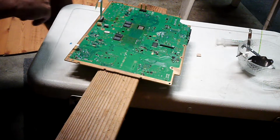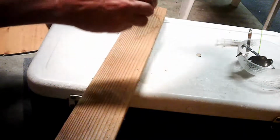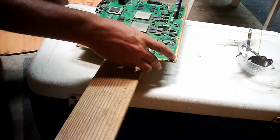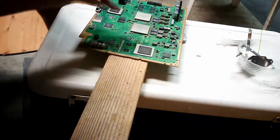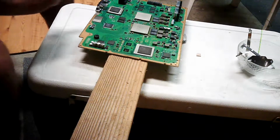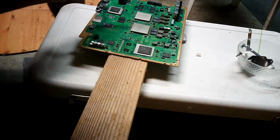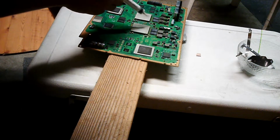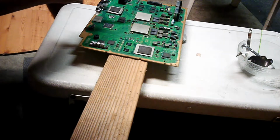Alright, this is cooled down. Go ahead and flip this thing gently back over and put it in the same position that it was when you started this side, so that the prongs are hanging off the end there and this is flat. Okay, a note here. There are so many different ways of putting on heatsink compound. It's ridiculous. One of them, which started way back in the day, is to put a line on here and draw a credit card across, like you're doing a gasket of a car or something like that.